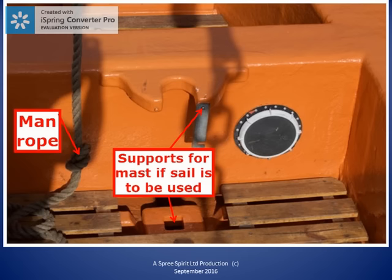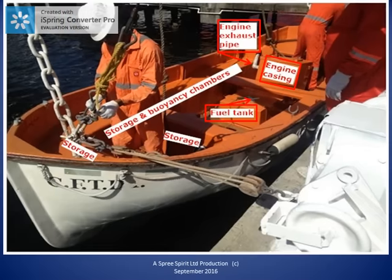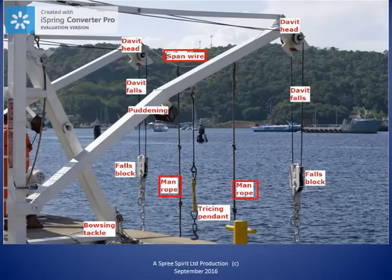On the left, we have highlighted some more of the davit's features. At the top is the harbor pin. When the ship is in port, the harbor pins are used to secure the inboard lifeboat in such a way that it cannot be accidentally launched and damaged by striking the quay or jetty. Next, we see one of the gripes where it has been stowed out of the way. And we can see the davit winch motor, and just below that, the limit switch that we are going to discuss shortly.